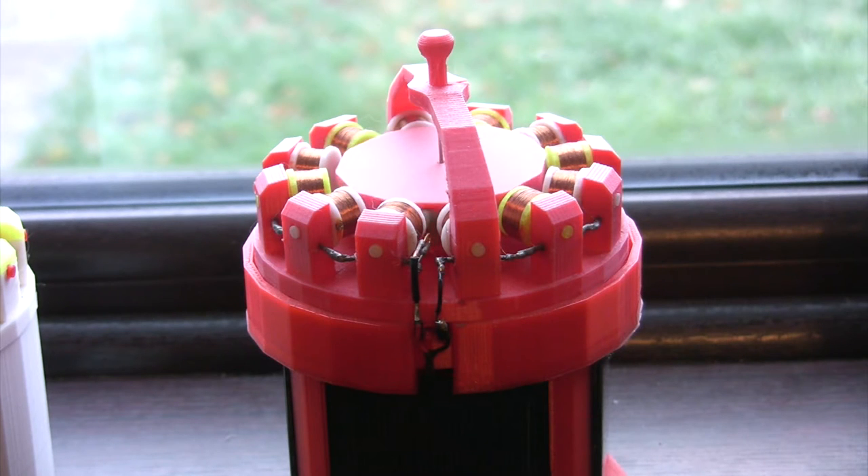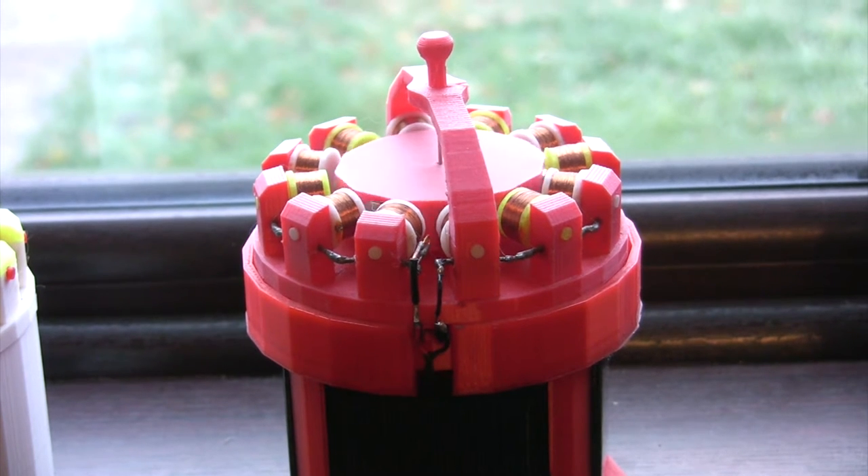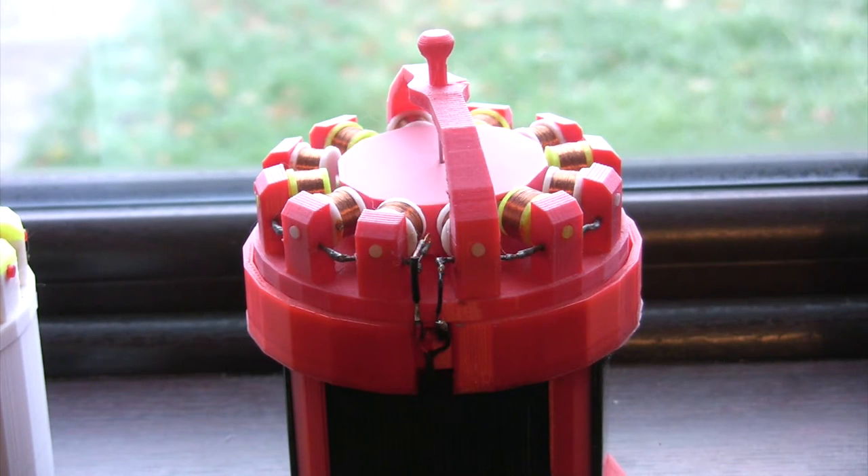Now this one, on the other hand, is doing great. If you remember, this is the first one that I made, and I retrofitted it with the solar cells and capacitors — four of each. It's also got four AA nickel metal hydride 2.8 amp-hour batteries in it, and that's been going great guns. It's actually never stopped since turning it on at the beginning of April, so it's been going seven months non-stop.